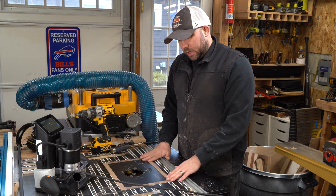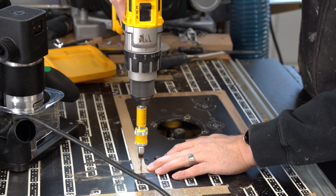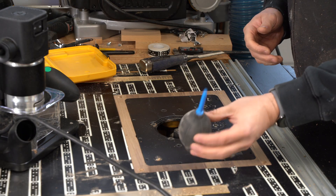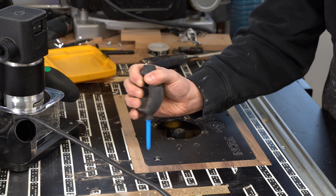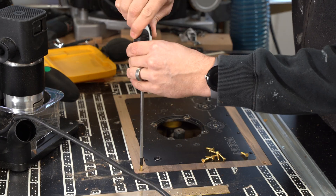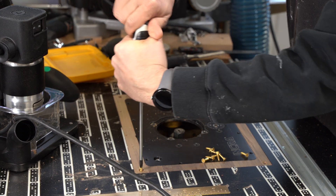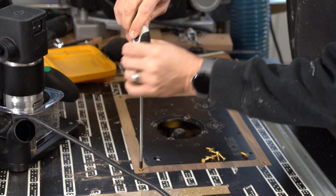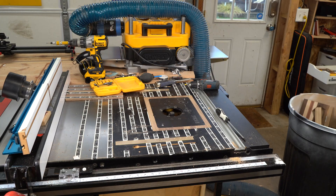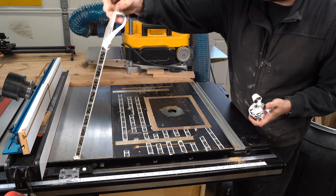This is looking good — it fits well and I'm very happy with it. Instead of epoxy or super glue, I pre-drilled for some screws to secure the walnut to the tabletop. I have a little dust blower that's actually for photography — I really like it for clearing dust from holes without having to turn on the whole compressor or constantly blow with your breath, especially if you're wearing a mask in the shop. Then I secured some brass screws. One lesson: don't use a drill for these, because you'll often break the brass screw — if you do use a drill, make sure it's on the lowest setting.